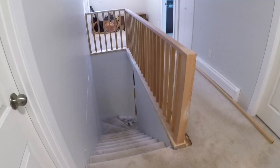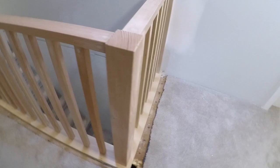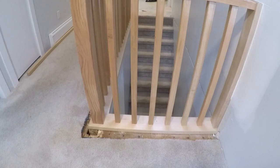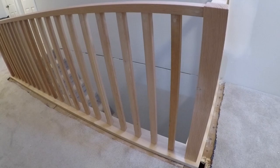The railing is done and all the spaces are looking pretty good. On this side I did the same math and the space wound up to be three and five-eighths — compared to three and thirteen-sixteenths on the other side, which is a three-sixteenths difference for the spaces, so not perceptible to the eye. That's one method for calculating your spindles.